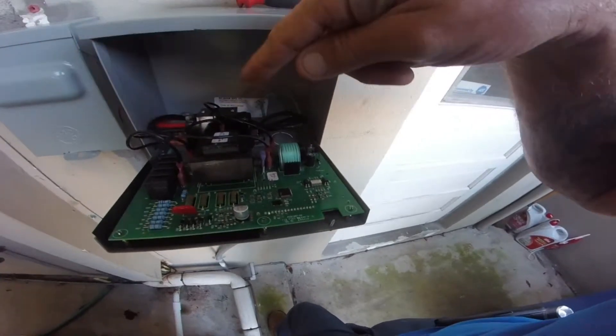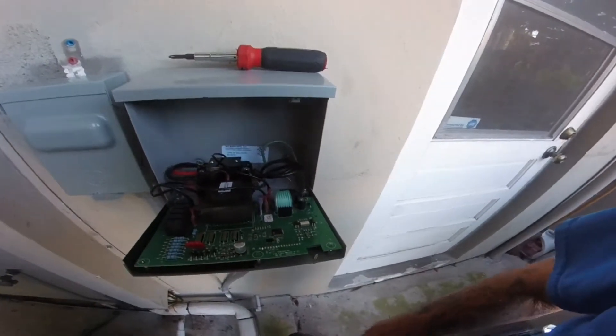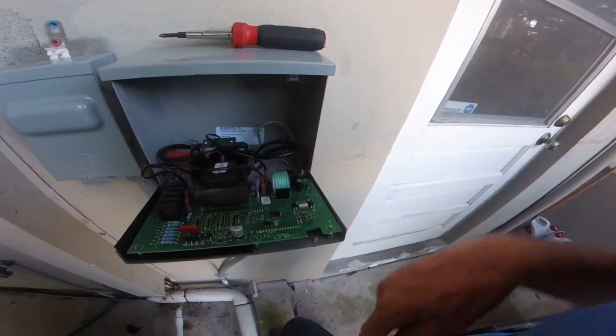You can see these wires are plugged onto the contactor. It's monitoring the voltage in. We have it set usually at 5% above the 240, so to kick it out at like 252 or 253 — I can't recall that off the top of my head.